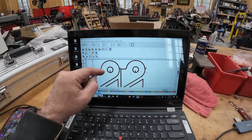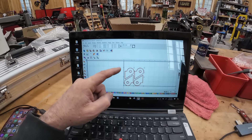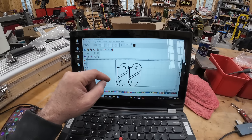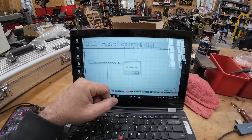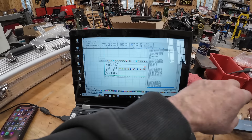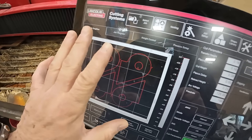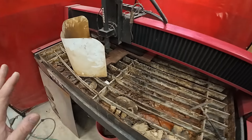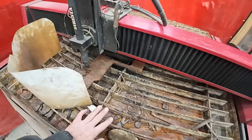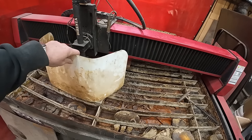These are going to become the hinge plates, on the plasma cutting software — the TorchMate CAD CAM version 9. In here you bring a vectorized image, maybe something from Illustrator or a PDF, and in here you can design and preview. We're going to output this onto the hard drive, load it onto the computer, and take it to the machine. The machine is set up and ready to go. We have quarter-inch plate right here and we're going to give it a shot. There's no water in the table because my hose is frozen — it's cold out.